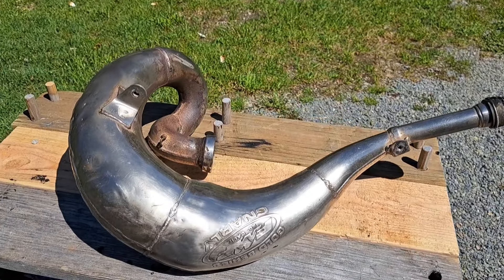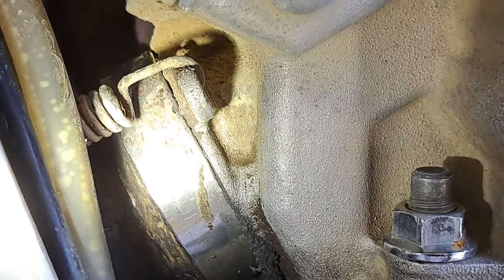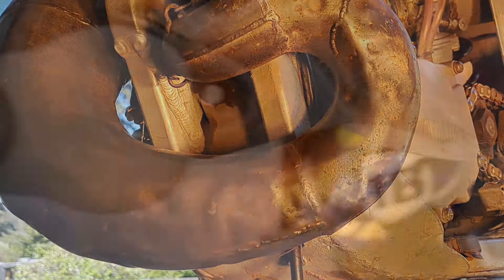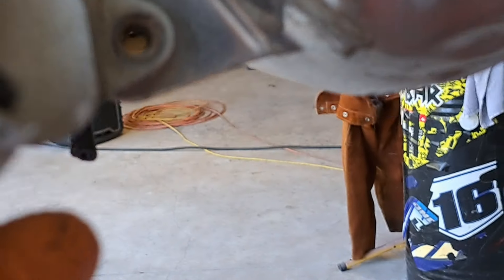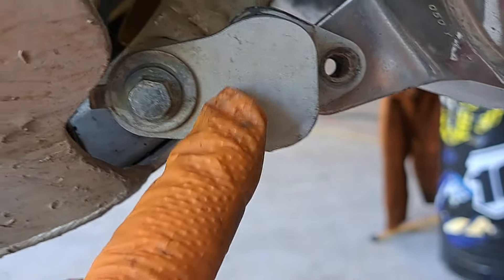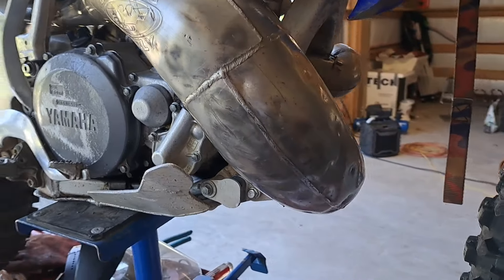The next question is: will this pipe still fit on the bike? Surprisingly, yes — it fits real nice. It sits flat against the cylinder head. Down here where a YZ250 is always tight, there's a little room there. It's not right against the frame, but really close — you can put a business card through there. They're always tight right in here. Looks like it's rubbing, but it's actually not. The forward bracket isolator hanger — that's really close, and I didn't even loosen this part. So it's not going to be under any load at all, and I don't have to do any hand straightening. Another beautiful repair — please like and subscribe to Krusty Cycle.